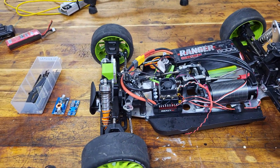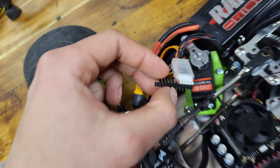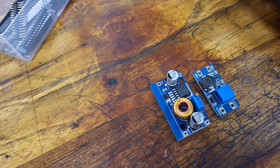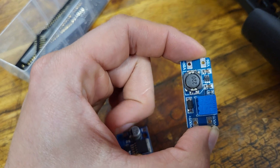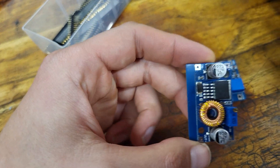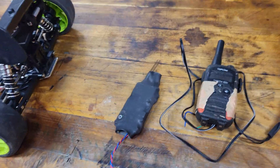I will share the rest of the knowledge I have about power supply and sound. For power supply, I'm suggesting you get these so-called pin header strip board connectors, so you can trim them to the size that your connector requires. Also, good things to have while working on RC projects are step-up and step-down converters. One can increase voltage if your air unit requires higher voltage than your battery, and another can both increase and decrease voltage. I will leave some links in the description.